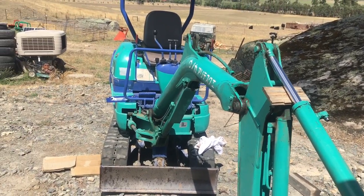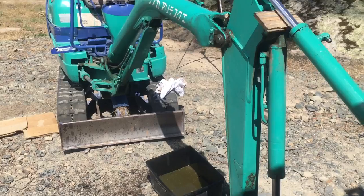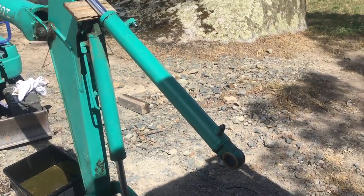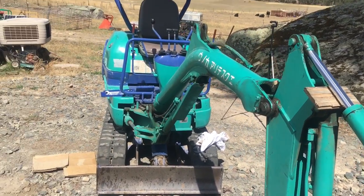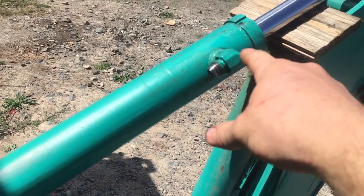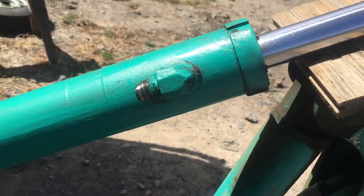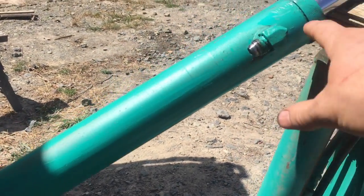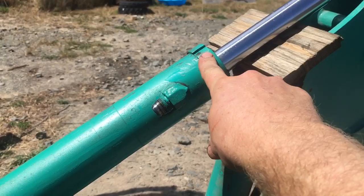So far so good. I've moved it over to the workshop and propped the front arm so it's standing upright and supporting itself, so there wasn't a lot of pressure on this hydraulic ram. I've undone the two main fittings — this end is the cap end fitting and this is the rod end. When pressure puts fluid on this side of the piston it travels out, and when fluid goes in here it retracts back. Next I'm going to undo this part using a set of stilsons.